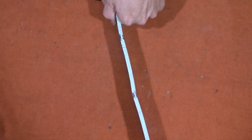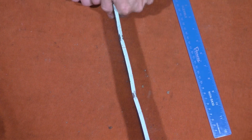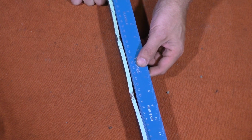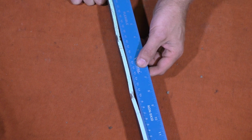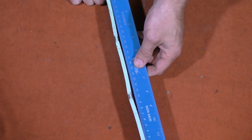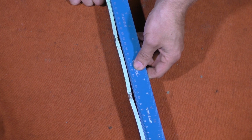Okay, this is 1/4 inch AR400 steel. The AR stands for abrasion resistant. They use this in the mining industry and all kinds of different things, and it's a very hard steel. That's what it's used for. It's like AR500, which is also abrasion resistant, but it is not quite as hard as AR500, but still very hard, and still hard enough you can use it to shoot at.